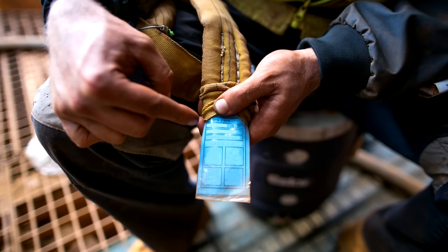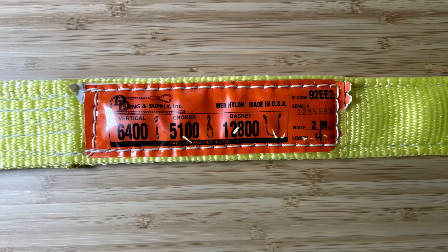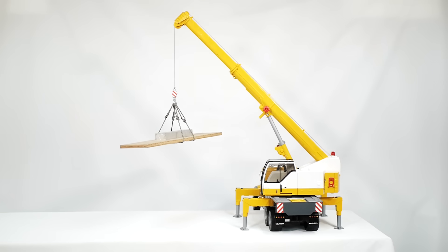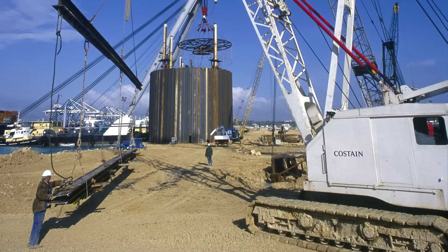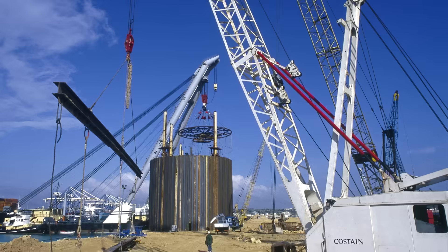If you're using a sling to lift something heavy and don't see a load rating tag, just stop. Every sling rated for rigging has to have a tag, whether it's a synthetic sling, a wire rope, or a chain. Even so, the vast majority of rigging failures happen because a sling was overloaded. You might be wondering why that's the case when the load rating is spelled out right there on the tag, but those three numbers hide quite a bit of complexity involved in rigging. I have a few examples set up here in my garage to give you a glimpse into those intricacies. Even if you aren't planning to connect a 20-ton beam to a crawler crane anytime soon, this information applies to lifting just about anything.